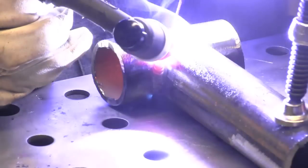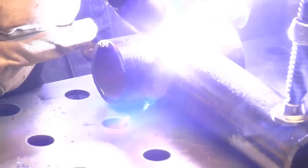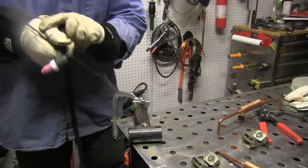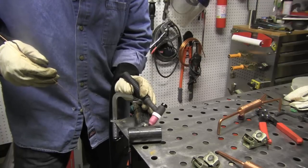That's the benefit of pulsing manually: you don't pulse the pedal until you're ready, until you're in position to feed the filler wire. Here I've got just a little gap so I'm not quite hitting it full pedal; otherwise I'm going floorboard each time I hit the pedal. I'm getting ready to swap hands here and go left-handed, and that's another benefit of manual pulsing — when you swap hands you're a little more clumsy and slower, so you just pulse whenever you're ready.